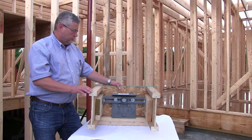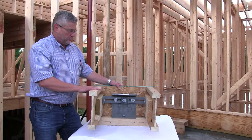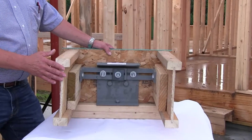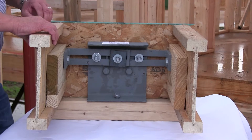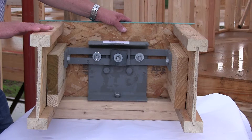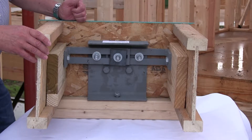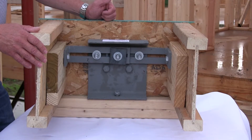The portion of video you just watched was for conventional sawn lumber joists, 2x10s and 2x12s. This mock-up is to show how the bracket would be mounted if you had engineered I-joists. The bracket is adjustable to a variety of widths from 12 inches to 19.2 inches. The only difference from conventional lumber is the need to add wood blocking in the webs of the TJIs to facilitate the bolting. Other than that, the balance of the installation is exactly the same.